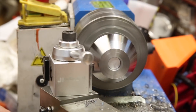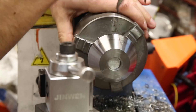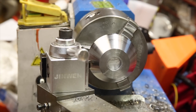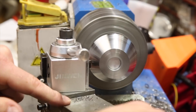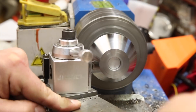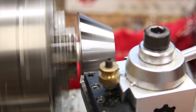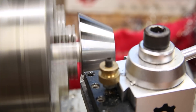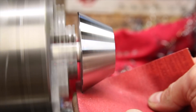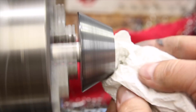For some reason, I noticed that the finish was much better when the cutting was done down the taper rather than up. Once the taper was the entire length of the part, I cleaned up the finish with some sandpaper. I'm sure it doesn't need to be as nice as I'm making it, but I want to deliver a quality part.